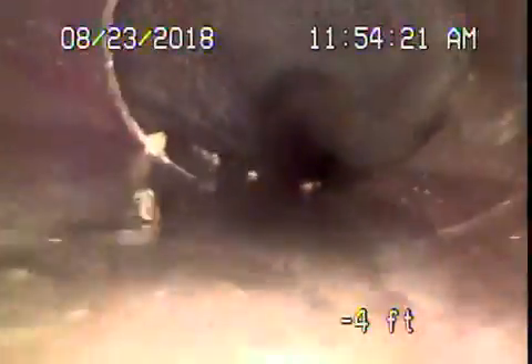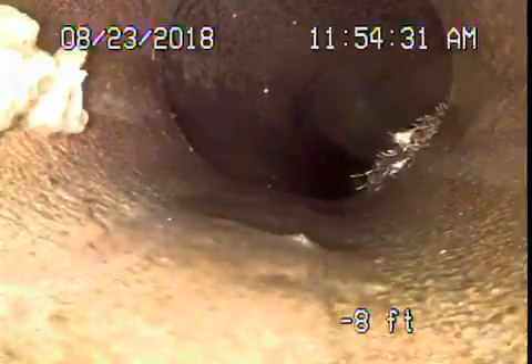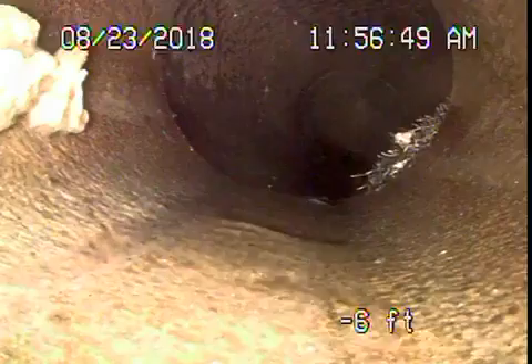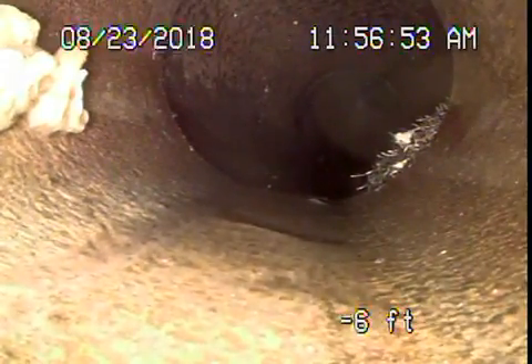This is in the alley here, and coming back is a 6-inch pipe transitioning to a 4-inch pipe. Maybe we could locate that, because maybe we don't have to go into the street. So we've located that now out of the alley. The 6-inch pipe doesn't look too bad in the alley. It comes to 4-inch now, where obviously there are roots and stuff in the line.